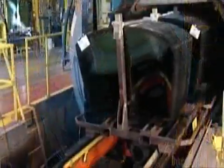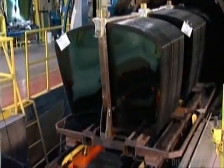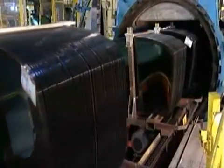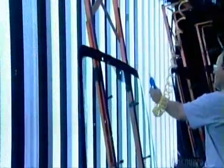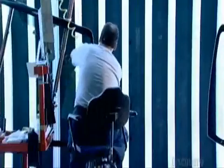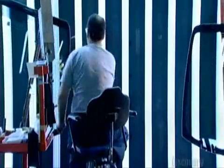This big blue chamber is an autoclave — it's like a pressure cooker. After about an hour in there, any remaining air pockets in the windshield are removed. A rail system transports the tub full of windshields to the inspection station, where each windshield undergoes a close-up inspection by a human. He searches for scratches, chips, or any contamination between the glass and vinyl layers.